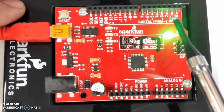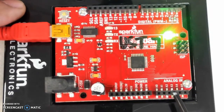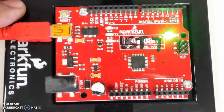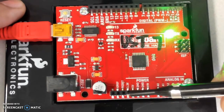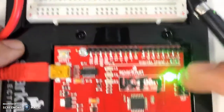So, 6 analog input and 14 digital I/O channels. And then, here's a separate bus or connector for power. If you want to power this board externally without using the barrel connector, you can also do it through VIN. There's a ground, two ground ports, a 5 volt port, a 3.3 volt port, and so forth. These 5 volts, 3.3 volts, and ground are useful for bringing power to the rest of the circuitry we might be building on a breadboard on this side, but more on the breadboard in the next video.